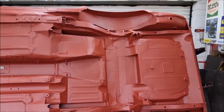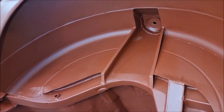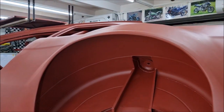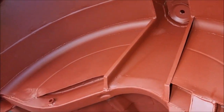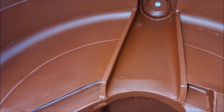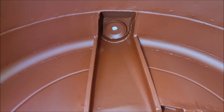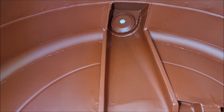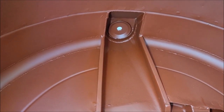That pretty much covers the underside of the car. I'll just walk through the rear wheel arch area. So obviously the big bubble wings have needed new inner arches and wheel tubs to take the 15-inch by 9-inch wheels and tyres. You can see the turret there, which will accept a vertical strut with coilover springs instead of the old angled ones.